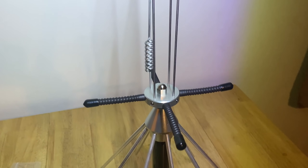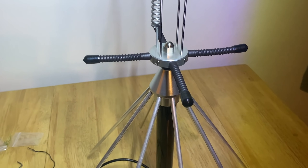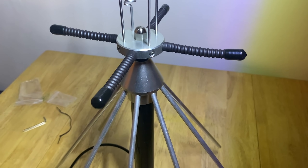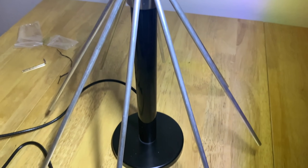The connection on the end of the four metre piece of coax is actually a BNC, so if you want to use this with an SDR then you'll most likely need some kind of BNC to SMA adapter depending on what device you're connecting to. The BNC connector is more suited to physical scanners, which is why it comes as standard.